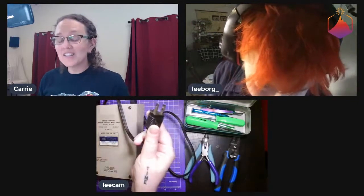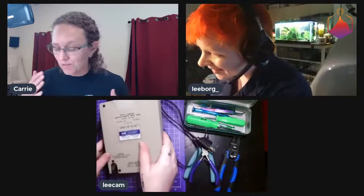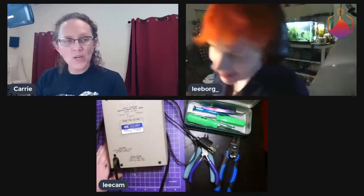Nice. And so yes, this voltmeter plugs into a wall in order to operate, and it's going to be unplugged while taken apart. Yes. Nixie tubes generally have like 100 volts feeding them, and so it's always good to take a gander without power to see if hopefully you can see something easy and obvious wrong with it. There is a warning on the back that says to make sure it's unplugged too. So everyone's on the same page here. Nice.